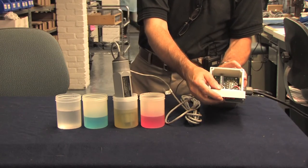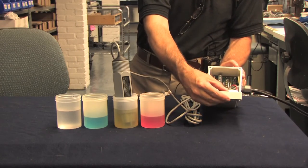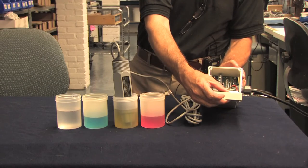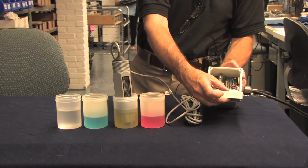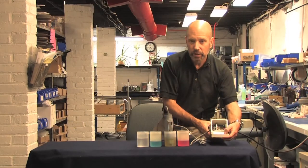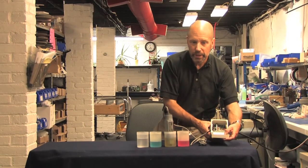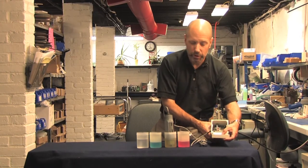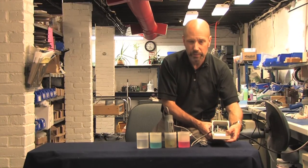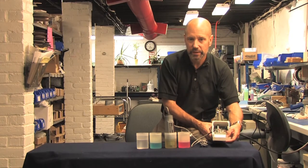We're going to go through the available menus. The fourth menu is titled Diagnostics, and that's what you want. We'll hit the left-right button to bring it up and scroll down until we get to a third item called Sensor Input. Press the left-right button again, and you're set to go.